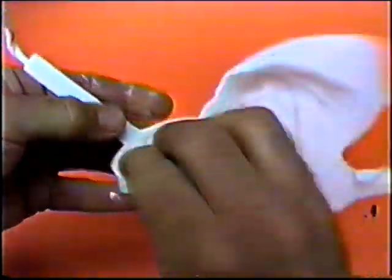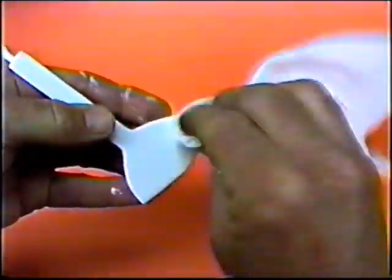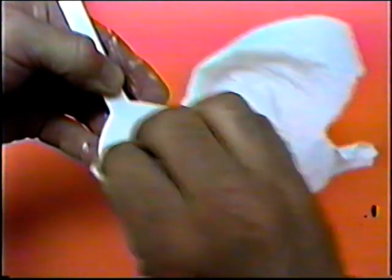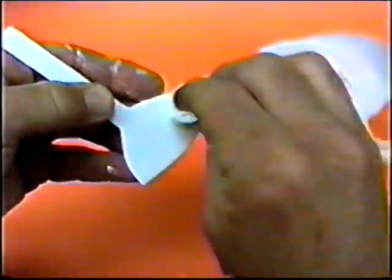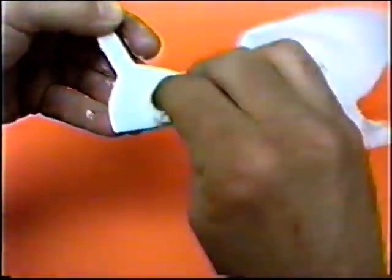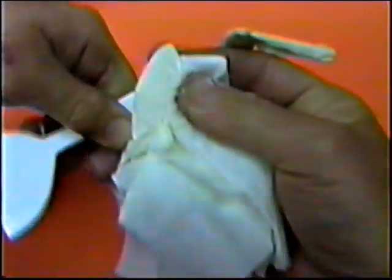And because I'm going to put this on a plane right away, the final shine gives it a little bit of a protective finish, but remember, that's another part of this whole thing: no silicone or wax. Try not to wax it with traditional waxes, because then you seal in the dope and it doesn't get the gas out, and it's not a good thing. If you can wait, hey, but in the meantime, you can put the final shine on. It gives it a little bit of a protective coating, but yet it isn't wax. There's no wax and no silicone in that material.